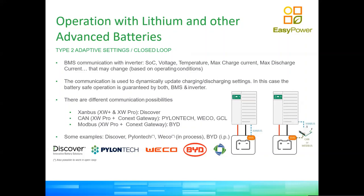So with that, now the BMS in the battery can give an accurate value of the state of charge to the gateway, which in turn can tell all the devices to reduce the current they are using to charge the battery, to slow down the charge rate to such a point that you can effectively take the battery all the way to 100%. And as well, you'll probably be able to drain the battery a little bit deeper, because now you have an accurate state of charge calculation. Unfortunately, this is not yet available for our market. This is only available for the UL market, which is the US, but it will be available to us this year. That's for sure.